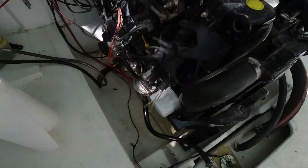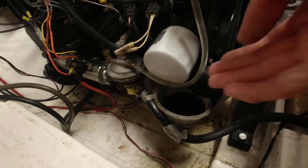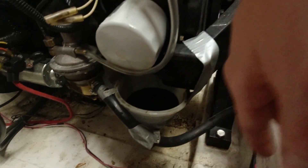I realized there was an oil leak a few months back by seeing some oil down at the bottom of the bilge. It's just a tiny little leak at this front corner — and no, it's not from the oil filter, it's from the oil pan gasket. You can see here I've got a little bowl duct-taped onto the fuel line and the engine mount there.